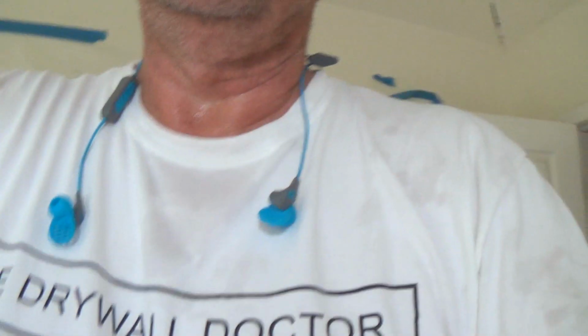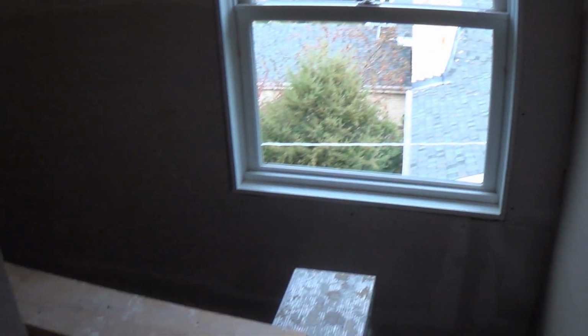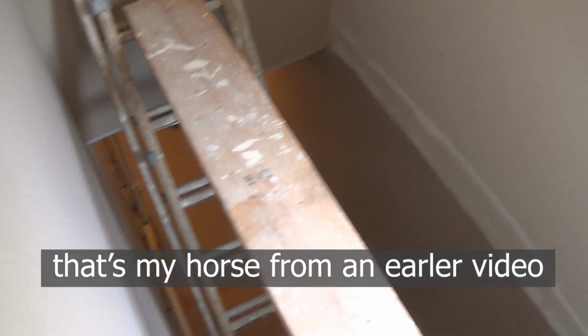But what I'm going to do is I have this window, of course, these 2 windows here, but this is why I did it. Because when I come out onto the scaffolding and this stairwell, and I'm doing all of this work up and around here, I'm going to tape this and top this right away. I'm not even going to hesitate. I'm just going to tape it, turn around, grab my topping mud, top it, pull the ladder and plank down so I can get up and down these stairs, and everybody can get up and down these stairs. So that's why I've mixed up the 2.